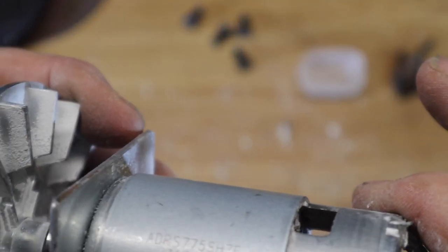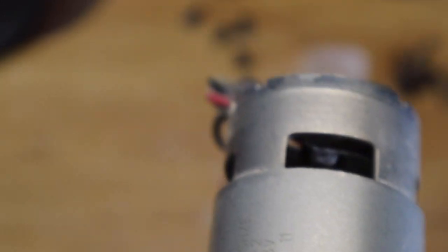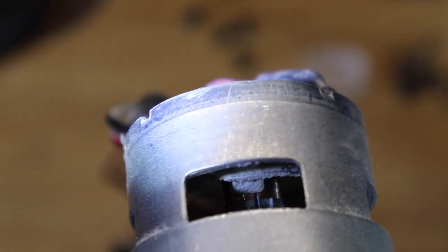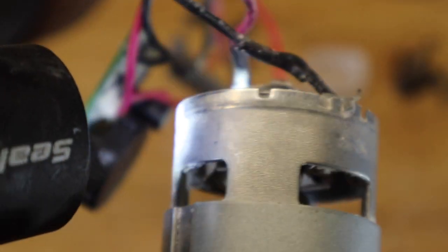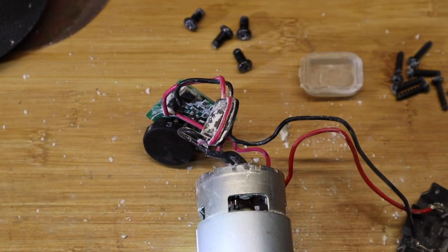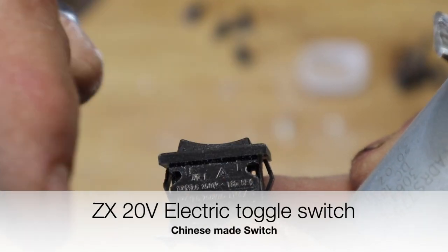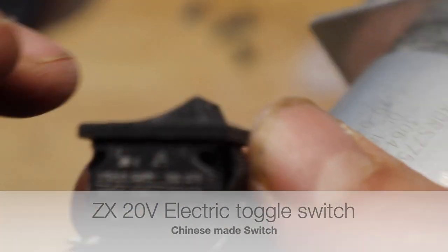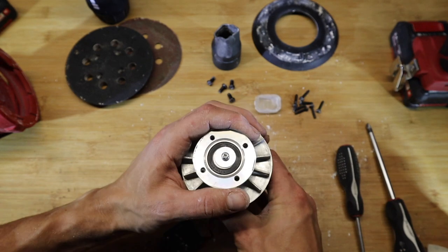I'll put the motor type and details as imprinted on the motor down below. Looking inside using additional lighting, you can see one of the brushes, the moving parts, the coils, and everything nicely epoxied in a big ball of epoxy. The brushes unfortunately are a non-service part — they're all encapsulated into the device, so once they're worn out the motor is worn out. The switch is nicely labeled — I'll put the details below. This one doesn't have TUEV markings on it, which is a little bit odd, as other Einhell products' switches do have TUEV markings on the body.